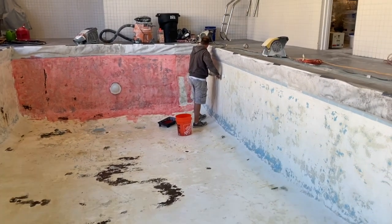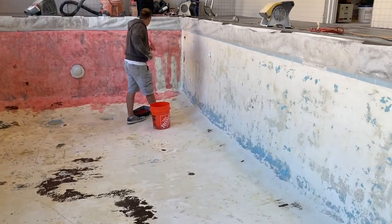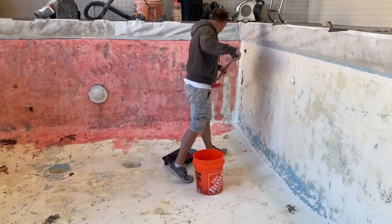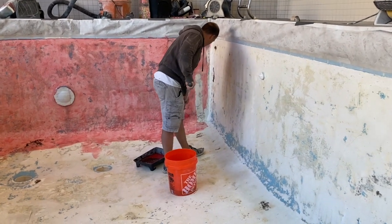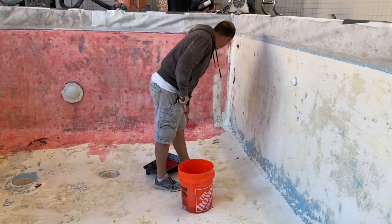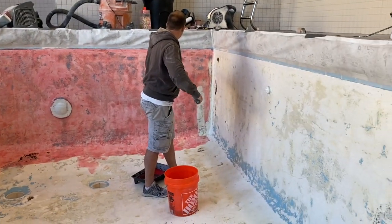the specially formulated epoxy. And this coat is full strength. There's no acetone cutting it. The pink tone is just a dye we put into it because it's very important that the flood coat evenly cover, and because it would otherwise be exactly the same color and tone as the undercoat, we wouldn't be able to see if we had a thin spot or something. So we just have this little powder dye that we put in. Everything's prepped.